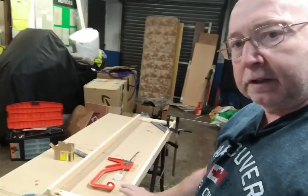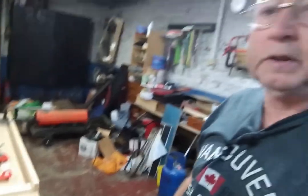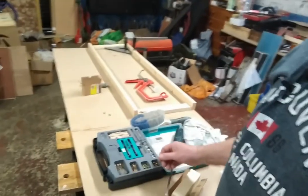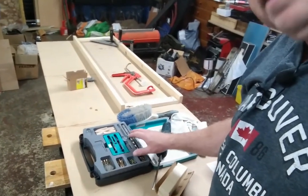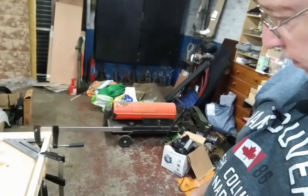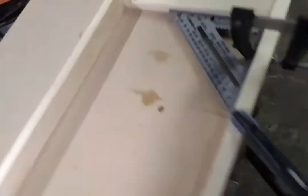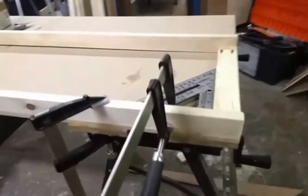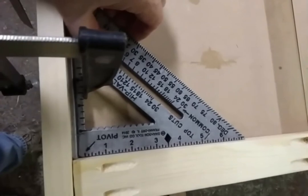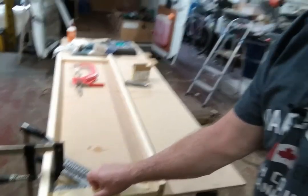The fascia is going to have two sliding doors in it, so I'm just making the frame for that. I'm doing it with pocket joints — I've just got the basic kit and it's fine. To keep my joints at a right angle I clamp the wood and clamp my square in there, and when you're gluing and screwing you just push it down against the square to make it easier.